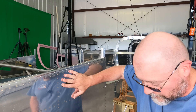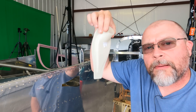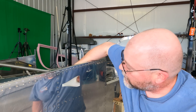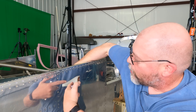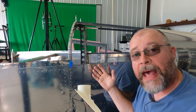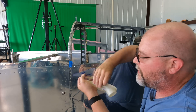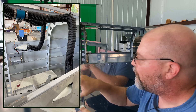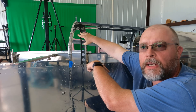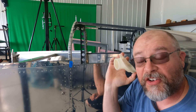The next thing is this vent hole — this is called a NACA vent. On the inside you need some way to funnel the air where it's going. I have this vent SV1 — I bought two of these, I should have bought four. This will go on the inside and line up such that the air, when it goes in, will be channeled down this two-inch hose, and this goes to your ventilation system. I also want to put one of these on either side in the back of the plane. I've made a template to cut and mount it, so there will be ventilation in the back bringing air through a hose forward through my tunnels for overhead venting. I'm going to order two more of these.